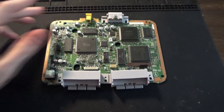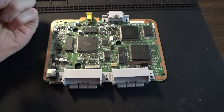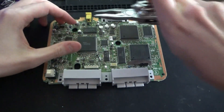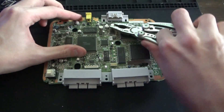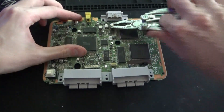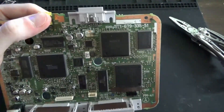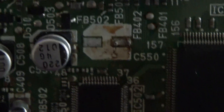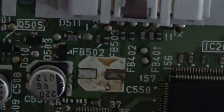I'm going to pull these off and show you how I do that. In my case I'm using a multi-tool, but the method I'm using is the twist method — you just put it on here and twist one way, twist the other, go back and forth gently. If you're lucky it'll pop right off; if the legs are really nasty like this one it'll come off pretty easy. All this crap is spilled electrolyte from the electrolytic capacitors — basically the capacitor spilling its guts and not being able to do its job, so no current or data is actually traveling through it from this video chip, preventing you from getting an output.